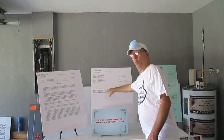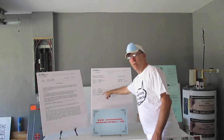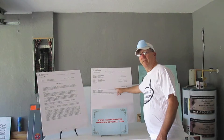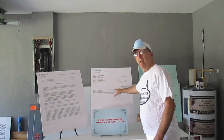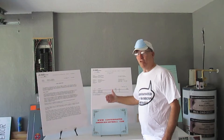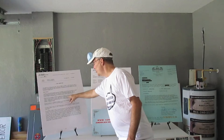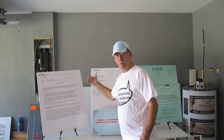Here's an example of what your test results should look like. It'll show these three gases, the maximum limit you should have, and then the results of your test. If your test is above the limits required, then that will mean that you have bad drywall, and it should meet the guidelines established dated March 18, 2011. That's very important, because anything prior to that doesn't count.